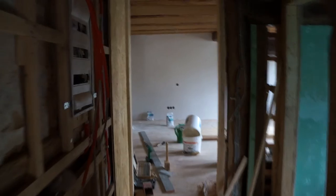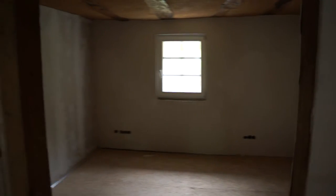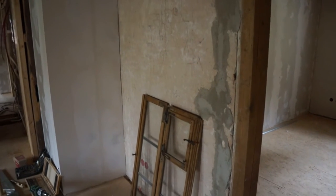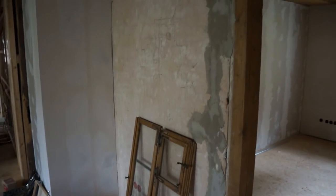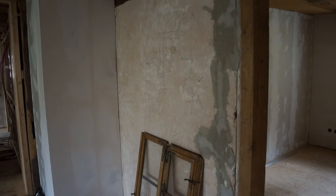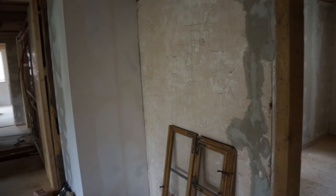Similarly, in the bedroom — well, I'm still not sure if it's going to be a bedroom — but the same job has to be done here. Since the last video, all the skim coats have been done, which is quite okay. I have to finish this one, and I have to do something special with this wall, which has cracks and all sorts of things in it, because the beam it was sitting on had sagged in the past. That's now supported down in the cellar, so just some special plaster and webbing or mesh to embed in. That'll be good to go, and then this room will be nearly finished, apart from the decorating.